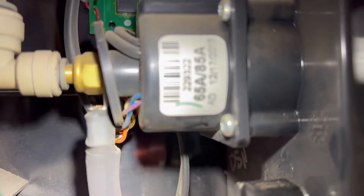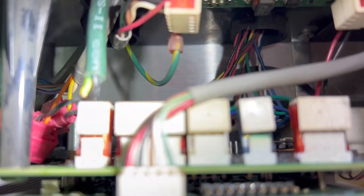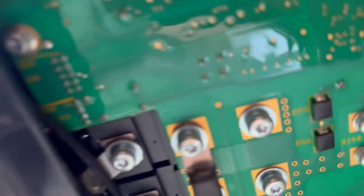In here — if I get my light right here — this is hooked into the orange wire and the yellow wire. I believe this is the same across the Hypertherm machine. Looks like orange is pin seven and yellow is pin eight. Again, this should be the same across all machines. I crimped on some connectors there. This is a Hypertherm Powermax 85 and the wires come up right into here and plug into this board.